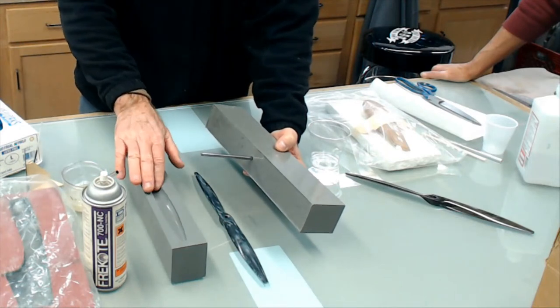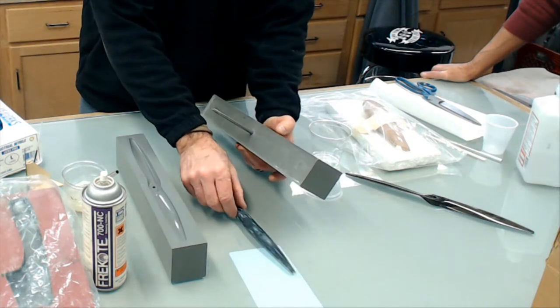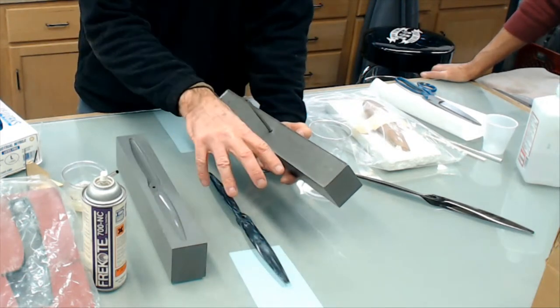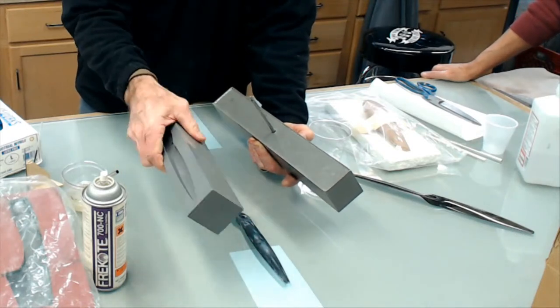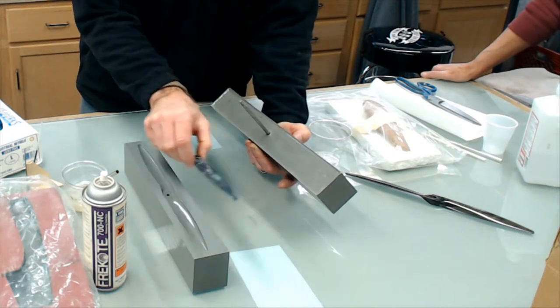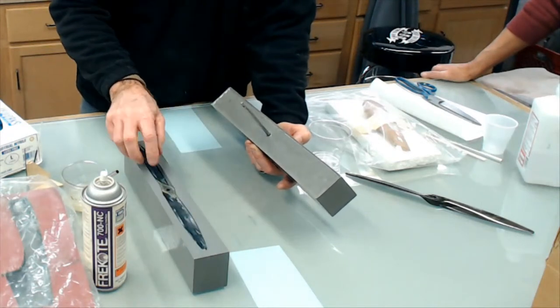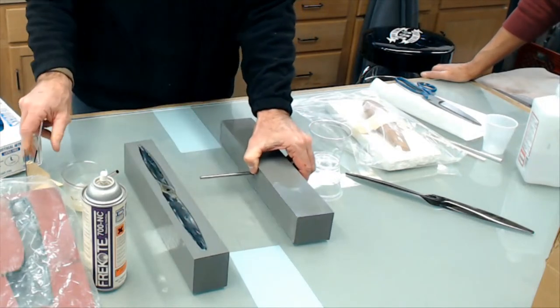When you do a prop, it's like the landing gear or the bell crank. You clay this up, the prop, you put the clay around at the draft angle, build the box, pour the resin. So that gets you this part here. So you flip it over, pull this out, like that. So this comes out. I think I can get it out.